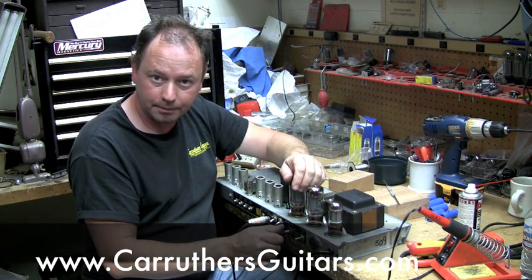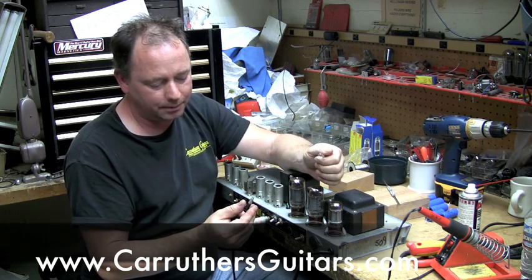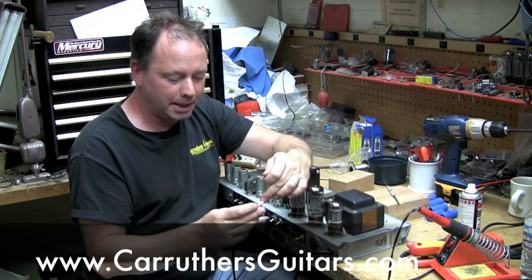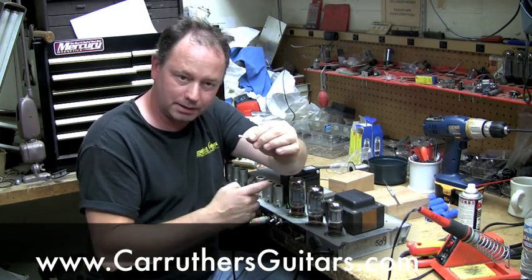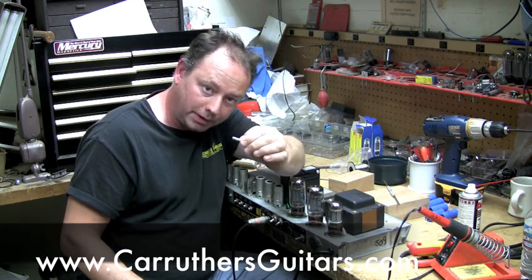Define what you mean by tinfoil bridge. Well, some people take the fuse out, and they say, well, the fuse keeps blowing, so I'm going to put a piece of metal in there that makes the current run again. Because this interrupts high current draw. If it's too high for what this is designed for, this fuse will blow. It'll interrupt the circuit flow and prevent fires.